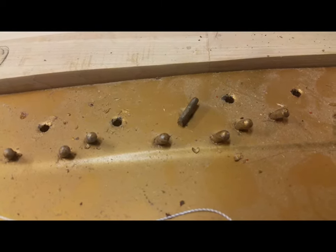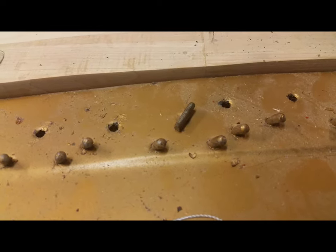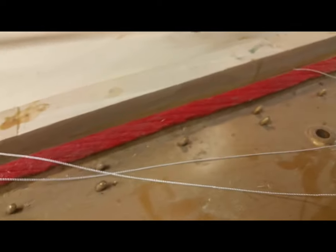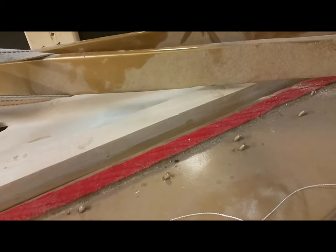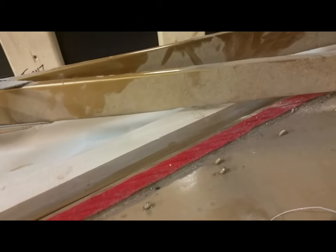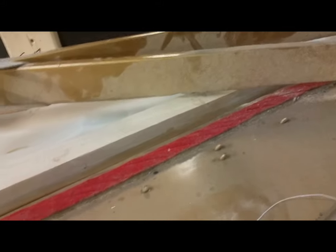You calculate the sine of the angle and the depth block needs to be about like a .045 punching. Then you get down in the bigger sections — the string is farther away, like about five inches — but I want a less steep angle on the string. So .045 comes out to about half a degree. I'm kind of thinking that's on purpose, maybe not sure, but sure is convenient for me.